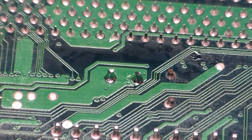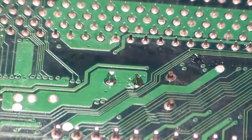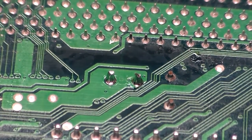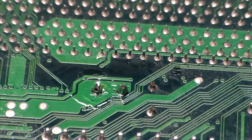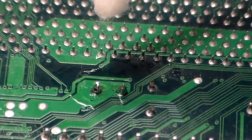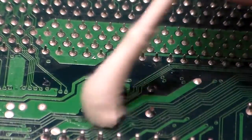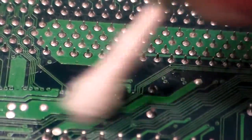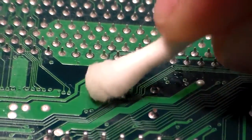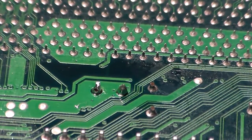There we go, that's a little bit better. There's still a little too much solder on there so I'm going to clean it up, then clean the work area with some alcohol and a Q-tip. What I like to do is get down with some reading glasses or a magnifying glass and inspect the work since it is kind of small. It turns out I didn't quite have a good enough solder joint on this one, so I went ahead and touched it up to make absolutely sure it's perfect. One last clean of the flux — that joint is now done.